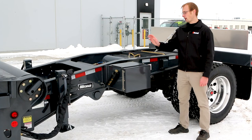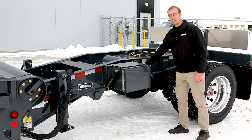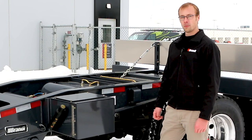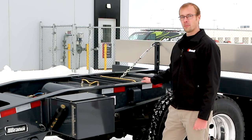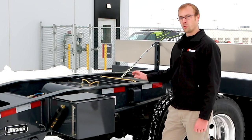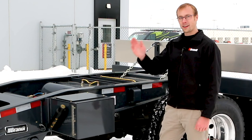At the front of this booster we offer a set of left-hand and right-hand dolly legs to make sure you can quickly position it to match up with the trailer in front and get you down the road quicker. We also offer standard remote air tank drain lines that can be easily reached from the side of the frame rail so the operator doesn't have to climb underneath. To increase maneuverability, we've optimized the steering angle to reach 25 degrees and added shock absorbers to decrease vibration and extend service life. This booster also has the ability to lock out the steer axle when traveling greater than 60 kilometers an hour to reduce booster steer and ensure it is tracking directly behind your truck, making your operator and everyone around this product safer.